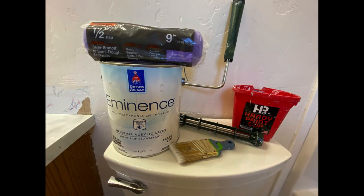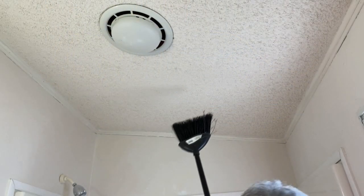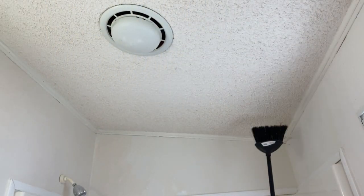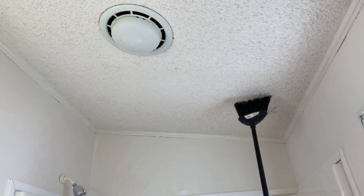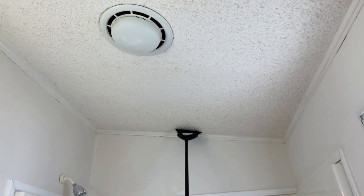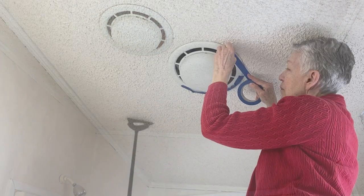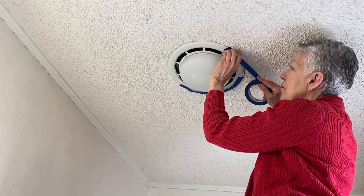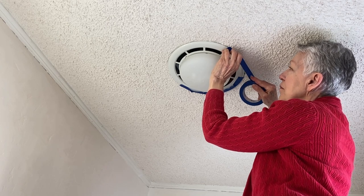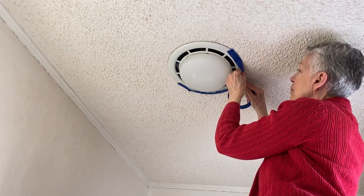These are the materials that I used for this project, and I'll leave more details in the description box below. Before I start to paint, I'm going to just sweep the ceiling with a broom to remove any dust or debris that might have accumulated there. I'm taping off the fan with blue frog tape. I won't be taping the area around the trim because I will be painting the trim after I paint the walls, so I don't feel it's really necessary to tape off that area.